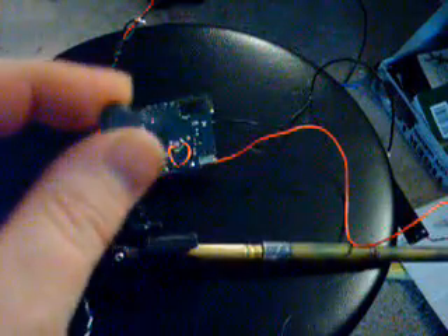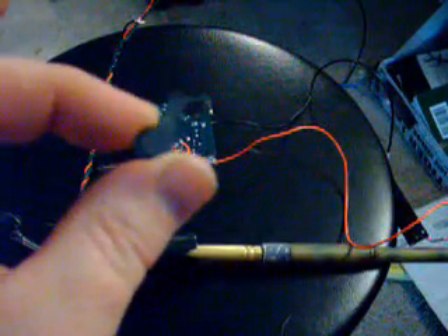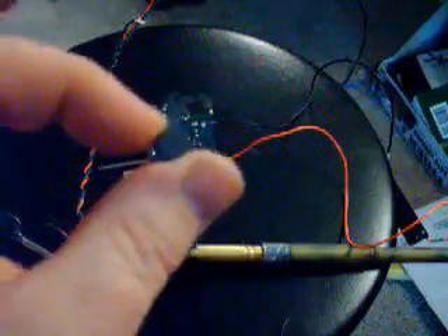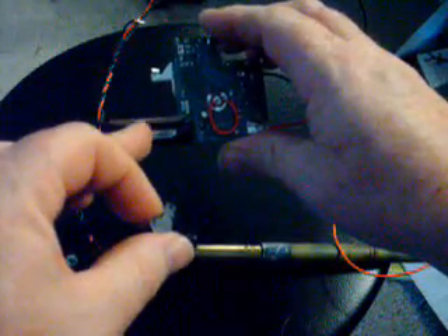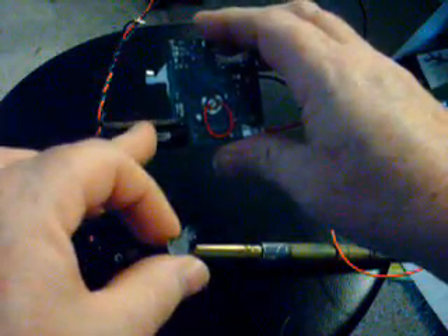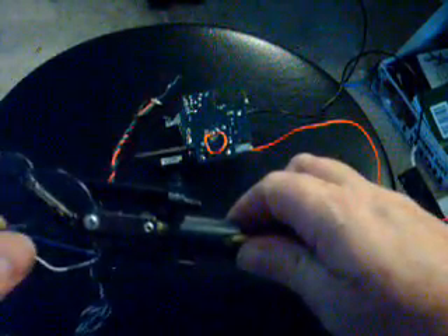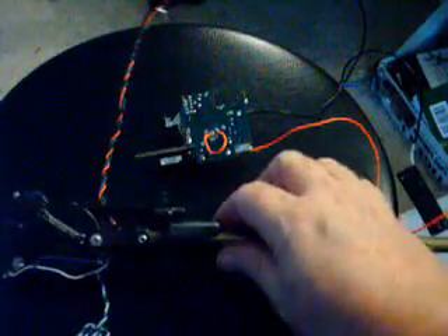Now, the way the camera operates is: this is the shutter. The shutter is connected right here to a spring — it's pretty tricky. As you push the button to fire the camera off, it moves that shutter. And as that shutter moves, there's a spring in there that contacts these two points here, and this is what discharges that strobe. We're going to cut these down and replace that with a micro switch that goes over here, so that when the barrel recoils it's going to operate that micro switch and shoot it.